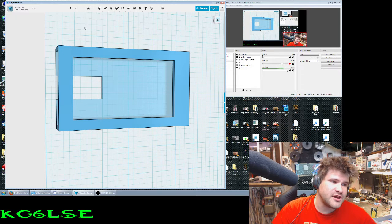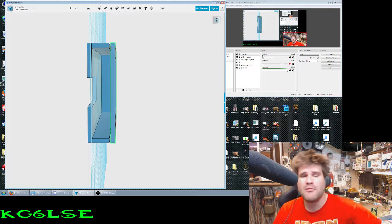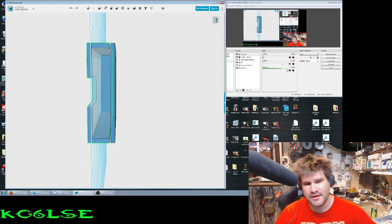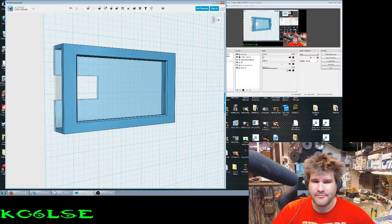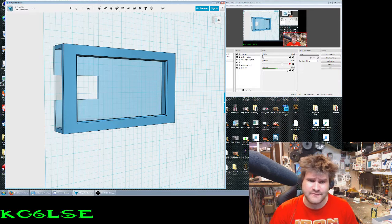Then you're going to reduce the thickness. You're also going to mate this down close. I did add one more millimeter gap because I wasn't too sure about how the thickness of the phone was going to react in this direction. I can always add some felt padding there, which actually wouldn't be a bad idea. It keeps you from scratching the screen. Then weld parts together, mate together completely, and add a chamfer, because it looks nice that way. And that's how you build a cell phone case in a few steps.